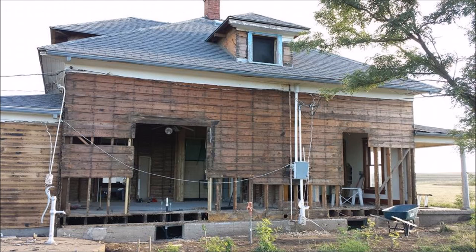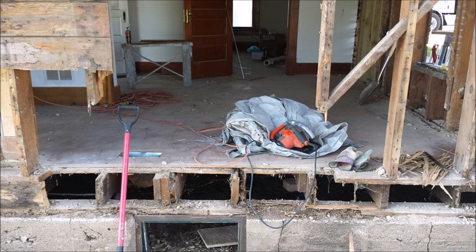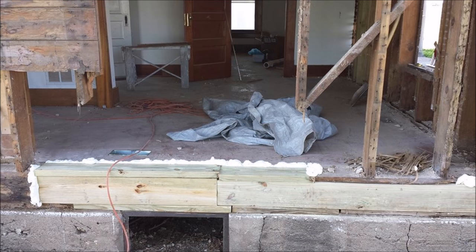It was completely covered in mold — unbelievable. I didn't get pictures of that, but now I'm working on rebuilding it, resheathing it, and reframing it. I wasn't expecting my sill plate and bottom plate for the walls to be rotted out, but they were. I took my Sawzall, cut it all out, and had to jack up the house a little bit. Thankfully I have pictures of when it's done.